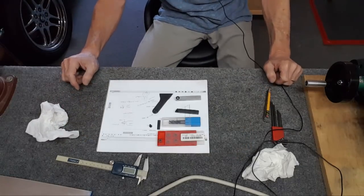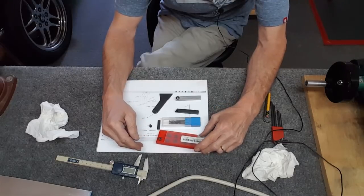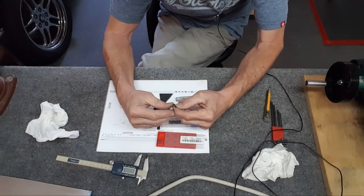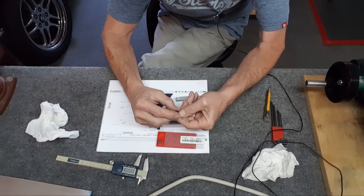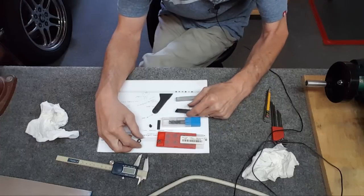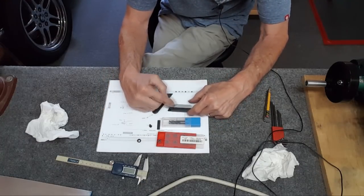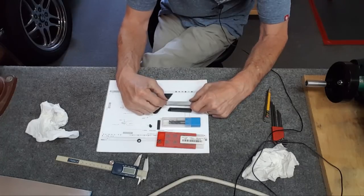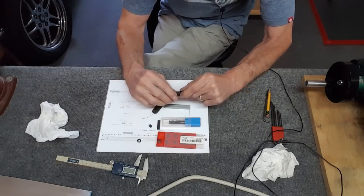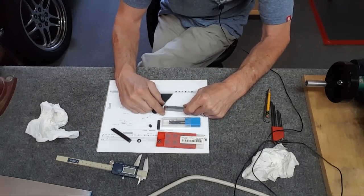Famous last words. Still wondering, these are Banggood inserts. They were dirt cheap, but they sure are smooth on the edge. And looking at them under the magnifying glass, they're kind of, I don't know. But, okay, so that 3/8 tool, I milled it close to 3/8. I wanted it a little bit thicker, maybe. Can always take it down, so took that down 40 thousandths.